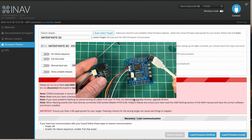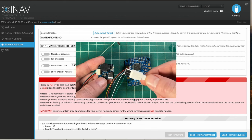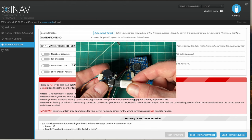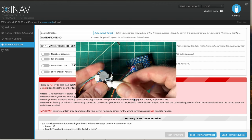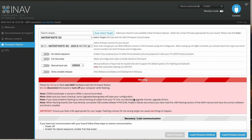If you'd like to go into iNav configurator and play around with some settings, go ahead and hook up your cable and plug in your USB port — this has to be a data cable. If you hear it beep, you can turn that off. Once inside iNav, maybe you installed the firmware already and restarted your computer. If you're on a PC you may need to install drivers.